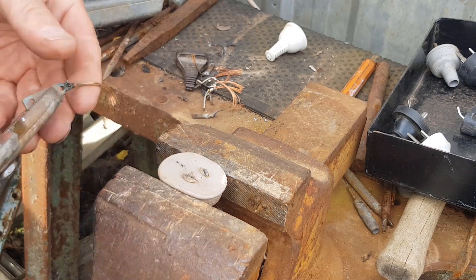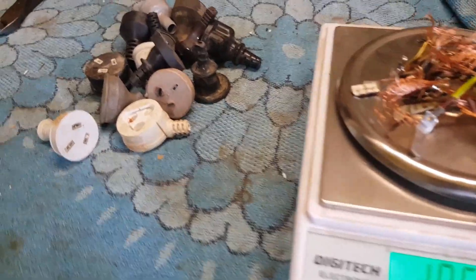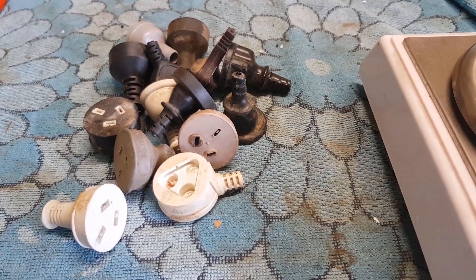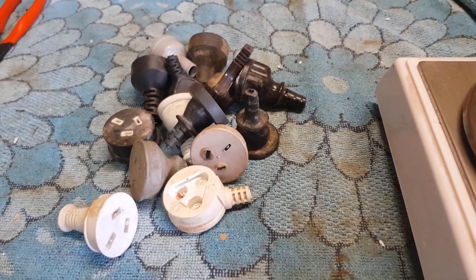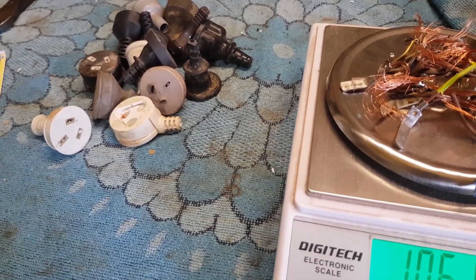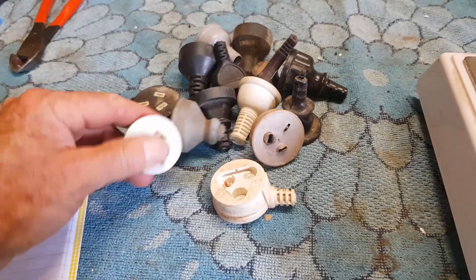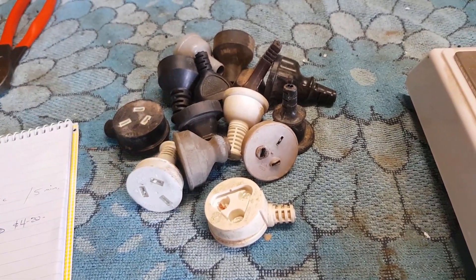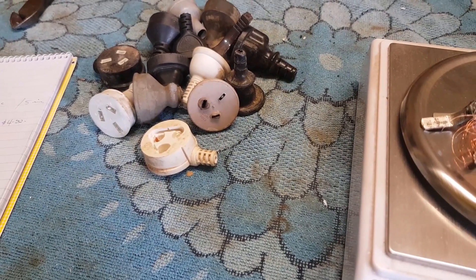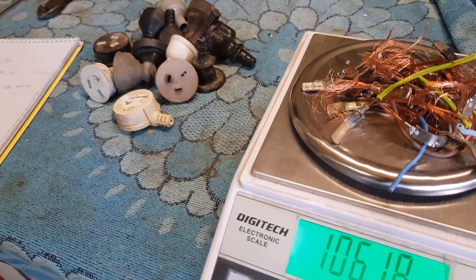It's about 15 to 20 seconds per plug, allowing a little time to swap plugs over, which will let us multiply out and see how we go on an hourly rate. Of course, you'd have to consider that doing this for an hour is fairly monotonous work and your hands probably start to ache after a while. The final analysis: out of about 16 plugs, it certainly did make a difference that the plastic was warm — they pulled apart easier — but with the vice method it really doesn't matter, so it's not necessary to wait for a 40-degree day.